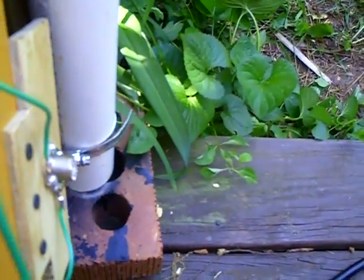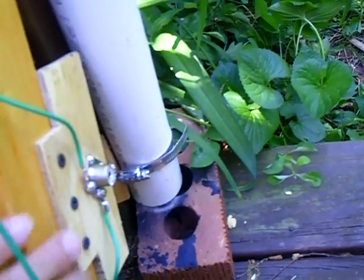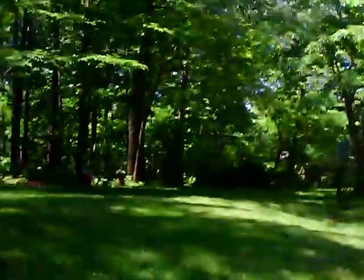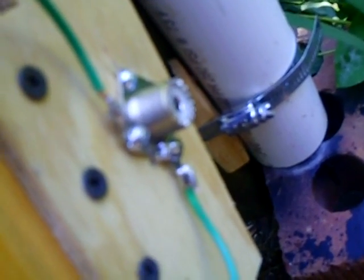What I got here is that I made this interface thing out of wood because my plexiglass was breaking all the time, so I just made it out of wood. The center conductor goes to the high part of the vertical loop, and I put silicone all around there to make it waterproof. The low wire of the antenna — the low part of the loop — goes to the outside part of the SO239, which is where the shield goes.